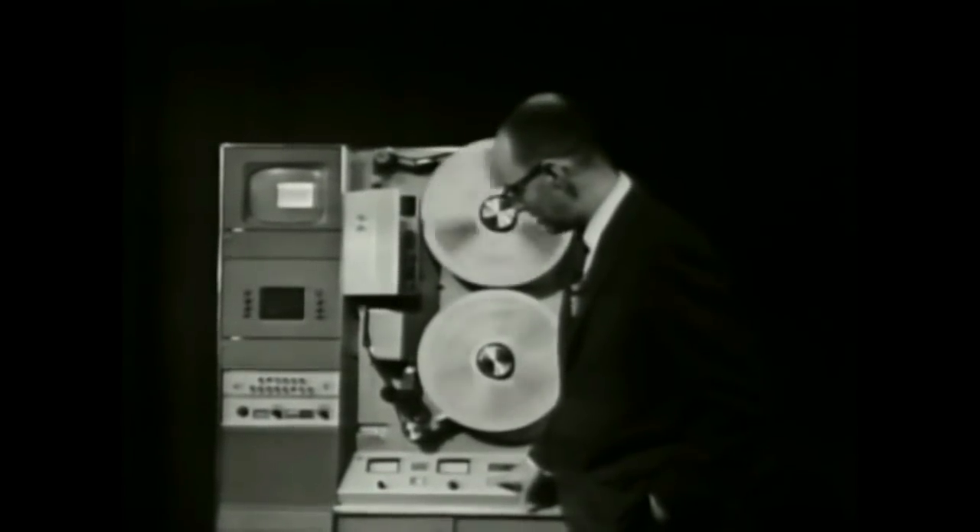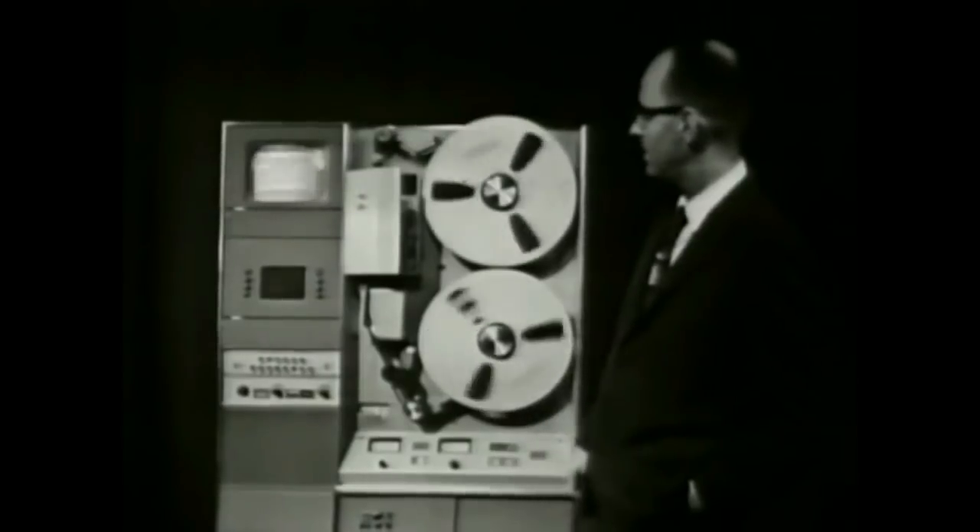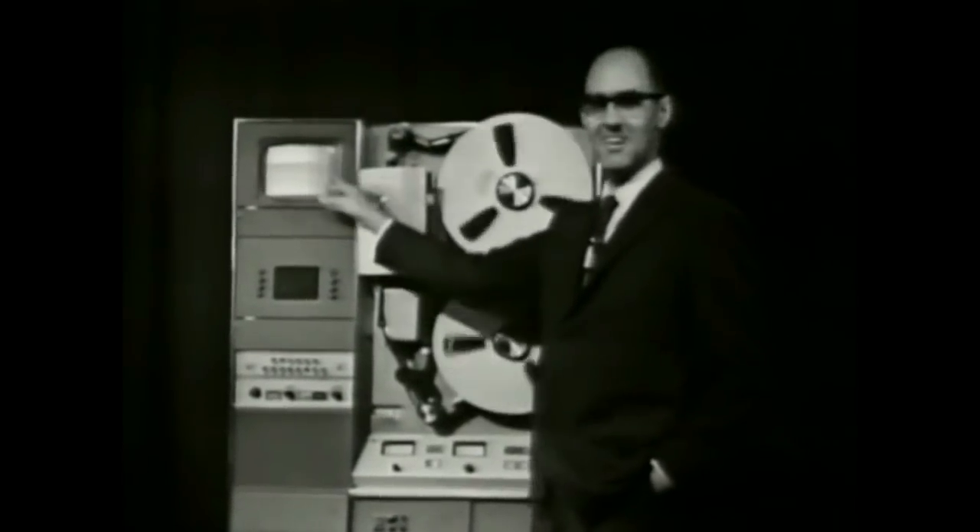To show why that is, I can deliberately misadjust the vacuum guide with a little adjustment here. I've backed the tape up in order to recover the signal needed to demonstrate this particular effect. Now if I put it back in the play mode and wait just a moment for the signal to stabilize, you can see a display on the picture monitor. When I misadjust this vacuum guide, you'll notice a very definite jogging or Venetian blind effect, wherein each band in the picture separates in such a way that the timing varies from the top to the bottom of the band. This is the basic error developed whenever the vacuum guide is not set to quite the proper position. We can take that distortion out by restoring the proper adjustment, and if you take it off in the other direction, the jogs go off in the other direction.